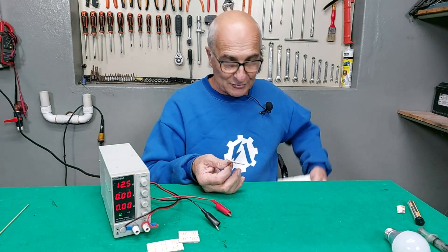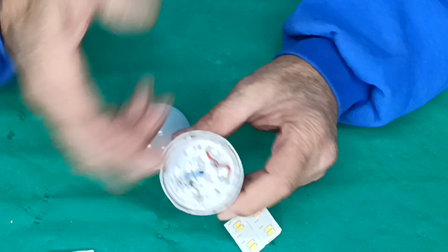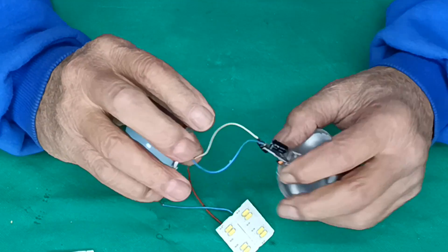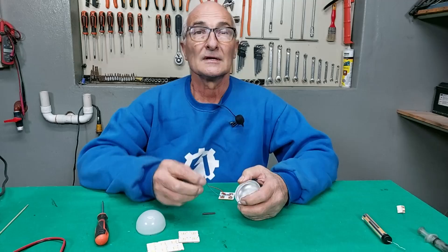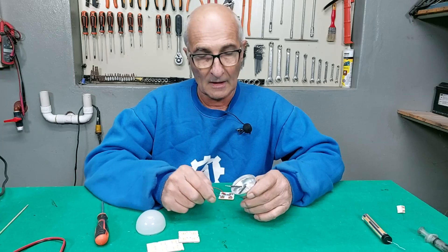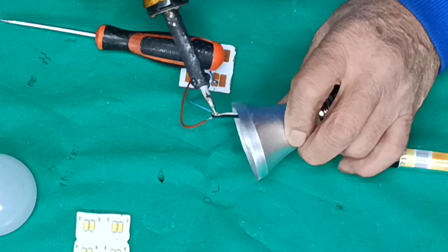Now let's see how to adapt it to a regular lamp that has burned out. This lamp has already gone through some LED replacements, but once they start burning they're no longer useful. We'll lift the board and find the electronics inside. We'll detach here, and now take two heat-shrink tubes for insulation where we'll solder the cables. We must be careful that the center pole goes to the positive of the LEDs, and the other will be connected to the negative.